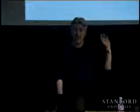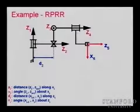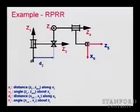Any questions here before we start? Good. All right, so let's start. I'm going to start by putting the z-axes and the origins. So z1 is along axis joint 1, z2 along z2, Z3 is coming out of the plane, Z4 is along that rotation, and there is basically no question. All of these are directly assigned, very simple.